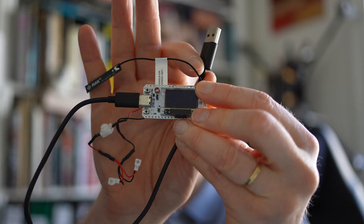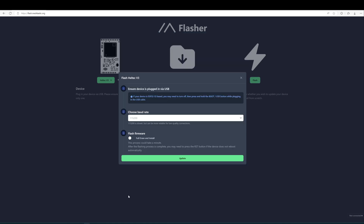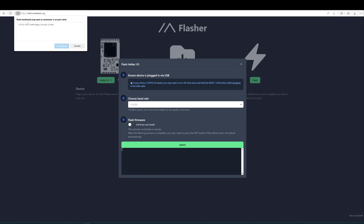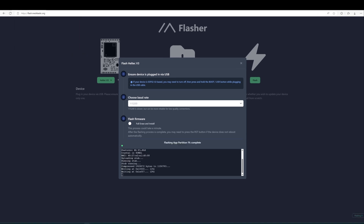Put the board in via USB cable so it boots, then press the Flash button. You'll see information about the release you selected — click Continue. Ensure the device is recognized via USB. You can change the baud rate — the speed at which the firmware is written to the board — but leave it at the default, which is more stable. In the third step, you have an option to erase the previous firmware completely; if you want to keep your previous settings, leave it off and click Update. Select your board recognized on the USB port — COM5 — click Connect, and the update process will begin.